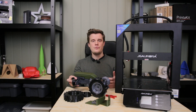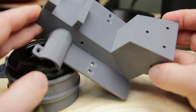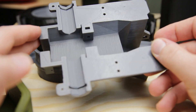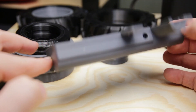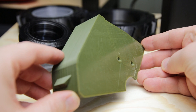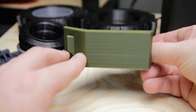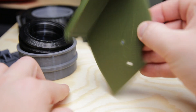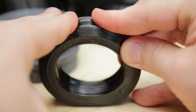The result looks really good. Starting with the biggest print — probably around 14 hours — the print looks good and you can see on the underside we have some overhang but it looks fine. This part here used some support and you can see the residue from the supports, but otherwise it looks nice. The green parts are really beautiful — look at the shine from the reflective surface, which was towards the build surface. On the sides you do have some smaller minor issues with ghosting and small layer vibrations.